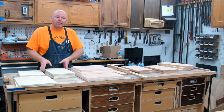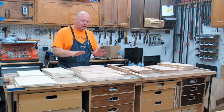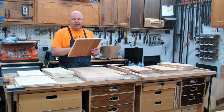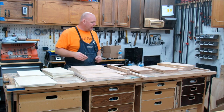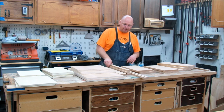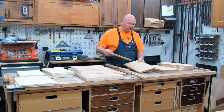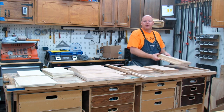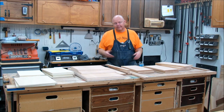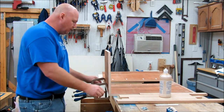I've got all my plywood pieces cut from the half-inch — I just went ahead and continued on at the table saw. We've got all of our parts for our drawers. Got the three-quarter inch plywood cut, all of our parts for our sides and our bottom. I went ahead and cut just a temporary filler piece, and all my face frames out of solid oak. We're going to have a nice three-quarter face frame on the front. I've also got all my drawer fronts cut out of solid oak — still got to join those together. All the parts are pretty much cut close to final length.